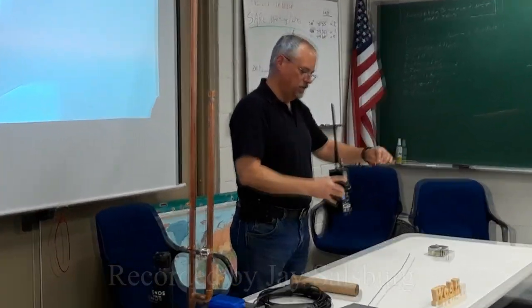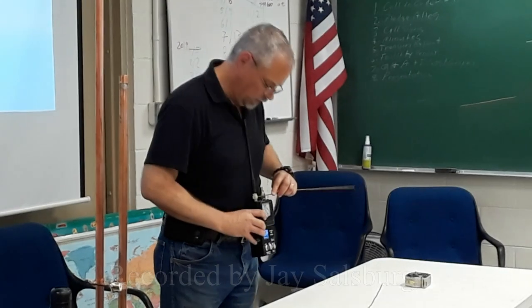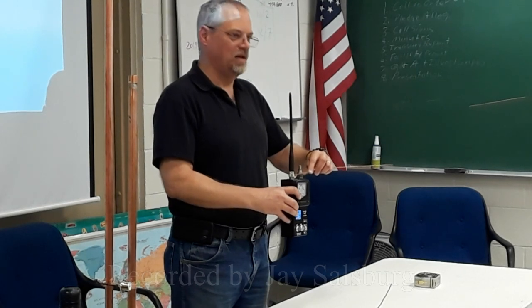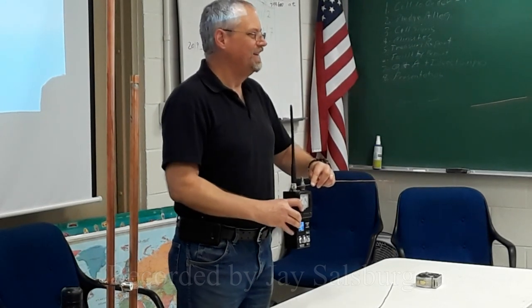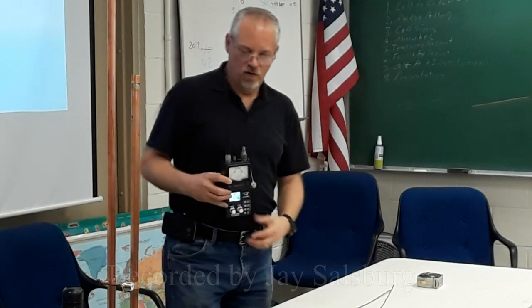Now, what happens if I put a quarter wave tail on it? It still holds it off. It's the same thing. So you have to have your handy talkie away from your body for the antenna to be in tune. Not a big surprise, is it? That's why the tip had to work.